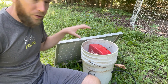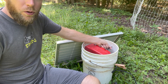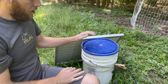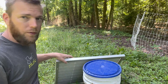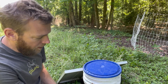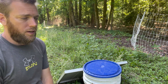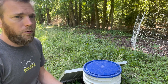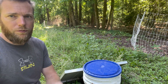Once you've got everything wired up, put the battery in the bucket first, then your solar charge controller, then your charger on top. Feed your wires through the holes drilled in the top of the bucket, then close it up — put a lid on it so water doesn't get in and it stays watertight. A waterproof Tupperware works just as well if you don't have a seven gallon bucket. Lean your solar panel against it for a good orientation to the sun depending on the season. I like the seven gallon bucket because I can pick up the handle and carry it — bucket in one hand, solar panel in the other. You could also put this whole setup on a small wagon or cart for longer distances. We're moving about 100 feet at a time since the nets are 100 feet long, so it's easy to pick up and move.